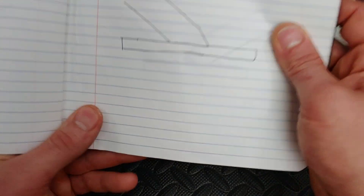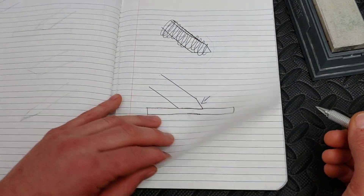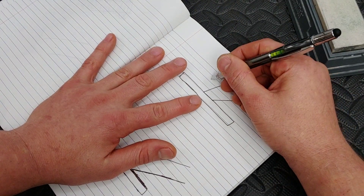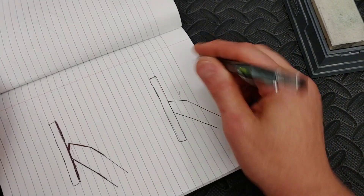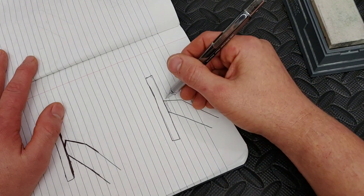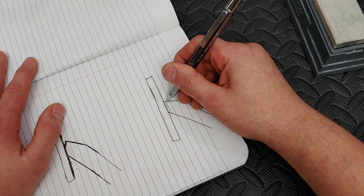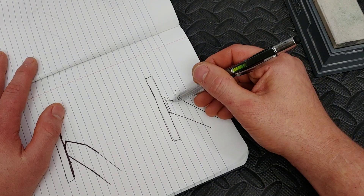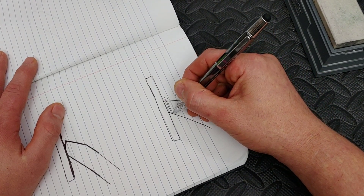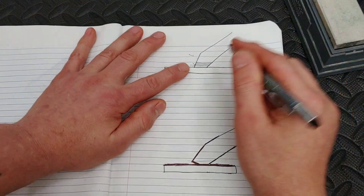A better way to fix it: we're back to the edge of 17 degrees on this side and 22 degrees on this side. What we should do is flip it over to the other side and put work on the 22 degree side. Now this is the 17 degree side, this is the 22 degree side, and we start sharpening it. What will happen is this will slowly remove steel from the 22 degree side of the edge. If we keep removing steel, it's starting to straighten it out — removing steel from this side, taking steel from both sides basically. Keep going a little bit more and now we're almost perfect.